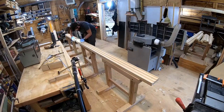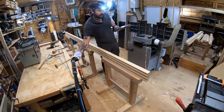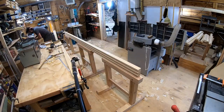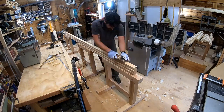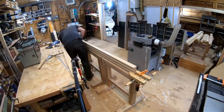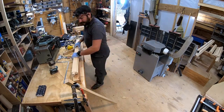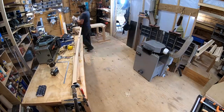traditional shiki. Once everything is done from a milling and joinery perspective, all the finishing has to happen, all the little details. So we chamfer all the edges, plane down all the faces to make it nice and smooth, and prepare for final assembly. You may be able to see some holes in this kamoi, and that is so that they can screw it into the rough frame. And I'm supplying plugs that will go up in those holes once the screws are in there, and you'll be able to chisel those away or sand them away, and you'll never be able to see that when the doors are in.